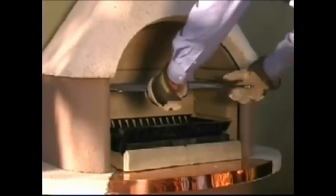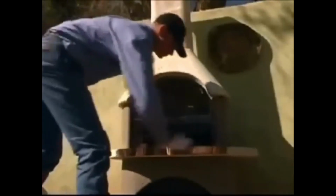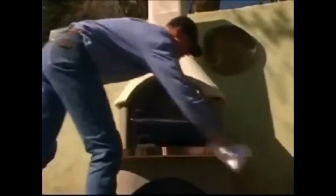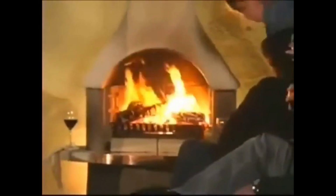Your fireplace grill will be ready to use in about 6 hours. The mortar is going to require 24 hours to fully cure and set. Take care not to overburn the unit with the use of high-burning coal, wood pellets, or other non-approved fuels. It is rated for 1300 degrees Fahrenheit. If the unit is wet, start with a smaller fire and allow the fireplace grill to dry out before adding more coal or wood. If so desired, the copper surfaces can be kept free of patina with the use of a copper polish or metal cleaner. With some basic maintenance and safe use, your backyard fireplace and barbecue grill will provide years of service.